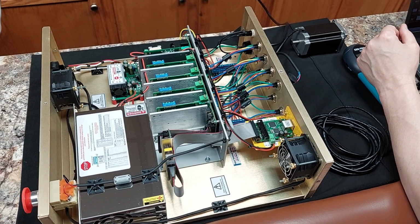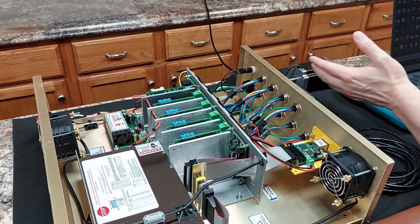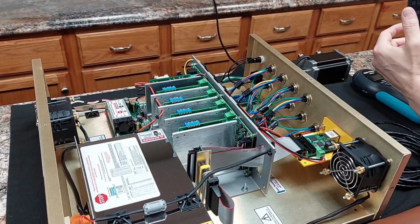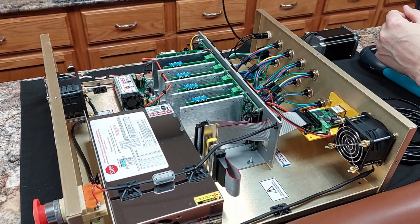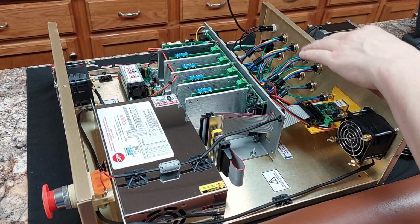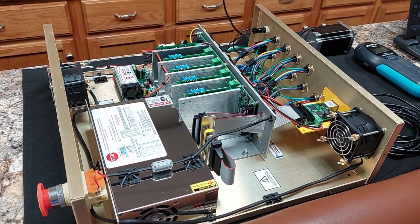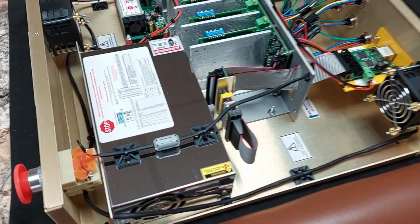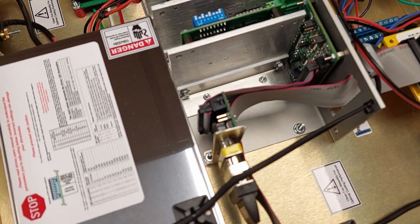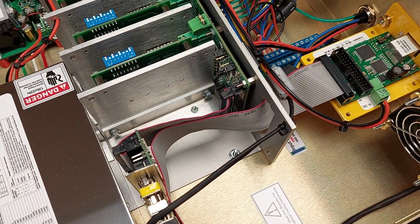And that's the good news. And why I say it's the good news is every time we engineer something and start with prototypes, there's always little hiccups. That's just the way engineering is. Many of you know that. That being said, the bad news is this X-axis drive works great, but the pinout on the DB25 we figured out is off on some of the pins and not correlating correctly with the IDC for the UC400.